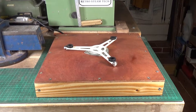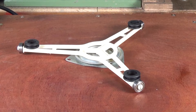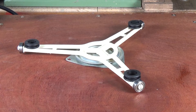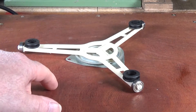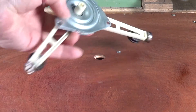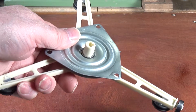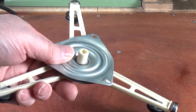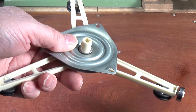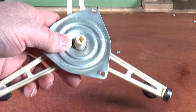Let's have a close look here. As you can see, this is the bit the plate would normally rest on in a microwave. I've made a few mods — basically it's had a couple of rubber grommets glued onto the ends to support the aluminium platter, and I've added a flat bearing here which gives the middle a bit of extra support. This was off my original manual wooden turntable. I upgraded the bearing because the original one wasn't very good — the table tended to rock. So I put one of these Lazy Susan larger-type bearings on that, which improved it no end, and it makes a good central support for the spider.